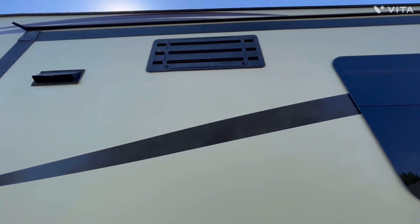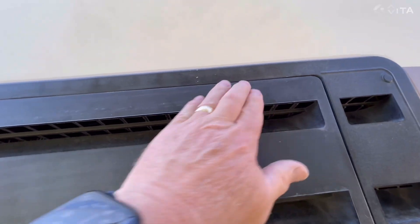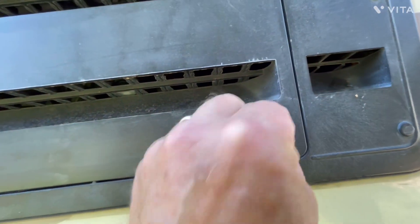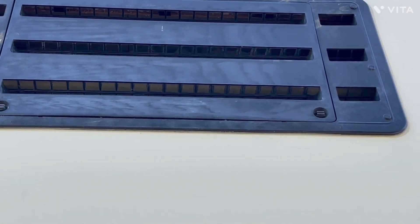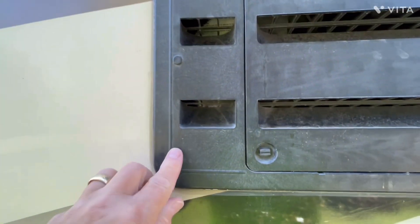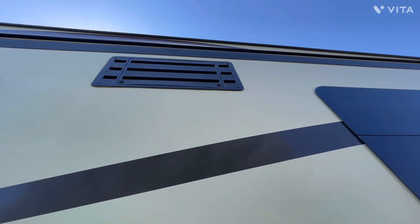We've reinstalled the upper and lower outside fridge vent covers. When you put these covers on, up inside there are two plastic tabs — you want to make sure those engage. When you put the bottom section in, press it in and then turn the tabs. If it's like this, it's not locked and it'll come open — you'll lose your panel. You want to make sure that tab is in and turned so the line is horizontal, same with this one. You can zoom up there and see that both are horizontal, so both panels are installed properly and they shouldn't blow off. The screw covers are in place on the bottom, and it's a good thing I came out here because we found that missing cap and put the new one in place.